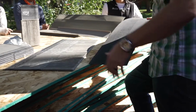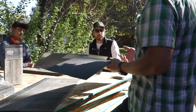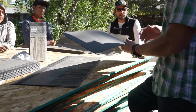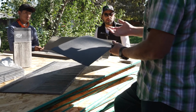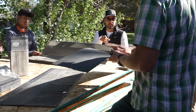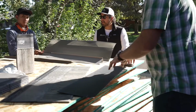The old stuff, which you still may see some out there, had different color splotches. We just did one recently and it had it. The idea there was for the Estate series, as it's got the clipped corners, that you would match it up to the proper color. The problem is that wasn't happening. Guys were not taking the time to put it on the correct color, so you'd have the wrong color showing through, which just looked bad. So we decided to go just to black. The universal starter doesn't have those multicolors. It's all just black, and it blends with the rest of it. It's a nice clean look under there on that first course. Anything other than that, it's not going to show.